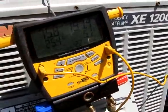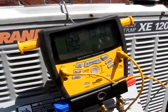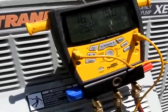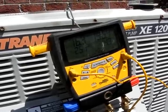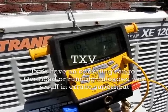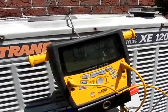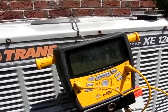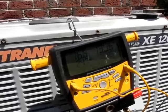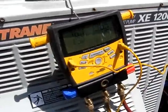We have about 25 degrees of superheat coming down. We've got 5 degrees of subcooling, and that's going up — 197 over 76. We're talking about TXVs that are loaded or unloaded can have trouble because they're at the edge of their capacity. Well, this one's definitely loaded down because it's in the 80s in that zone — it has its work cut out for it. So that superheat number should be coming down as we progress here. Probably need a little bit more refrigerant to get the subcooling up, but other than that we are good to go. Everything's working fine and I'm about to head to the next one.